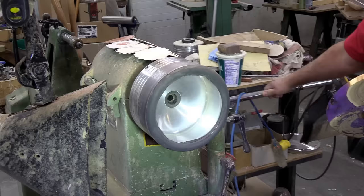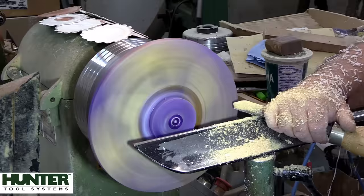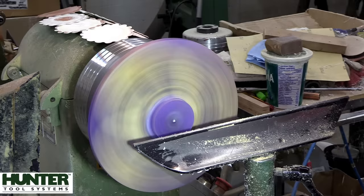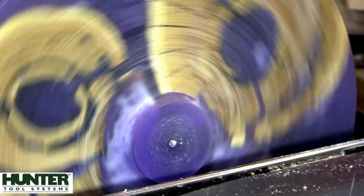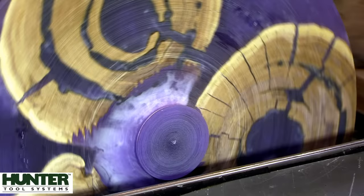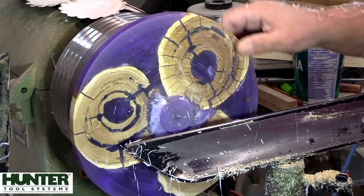It's a little slack and that's the way I made it. I'm using the 8-inch vacuum chuck which does have a fair bit of pulling force - you'd be hard pressed to pull this piece off, and that's exactly what you want. But sometimes that comes at a cost, which we'll cover in a minute. That's the Phoenix - I want to get up underneath that little knob I'm turning, and the Phoenix is a good choice because it's got that small little cutter on it. There's definitely lots of white near the knob, something I didn't see in the Hercules work. Eventually we'll sand this the same as we did the underside - 60 to 800, then buff and clean it and get it ready for finish.